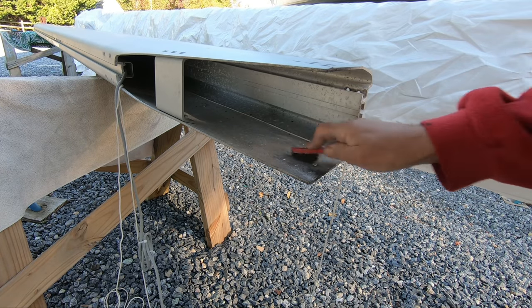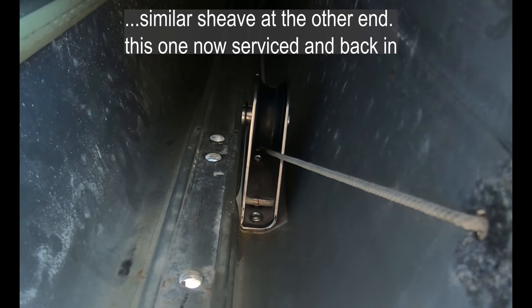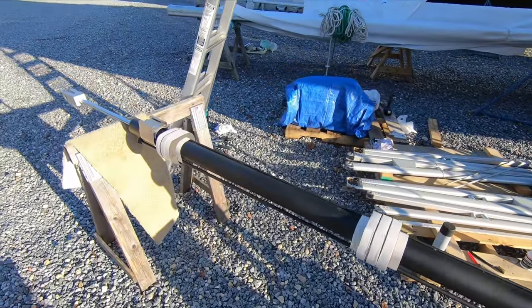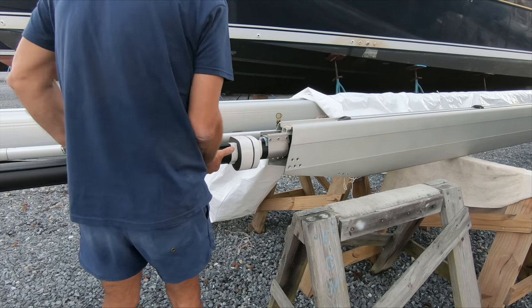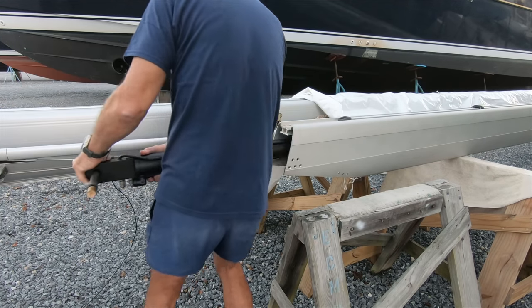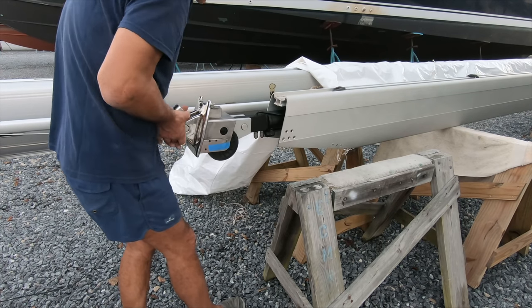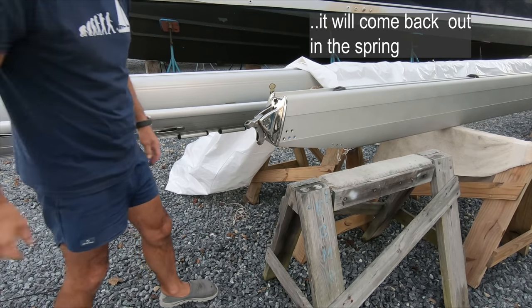This end gets all the salt, so when I put it back I'm going to put some sort of cover over here. I've put plastic and lanolin coat behind the pulley before riveting it in, and I'm going to drill a little hole in front of it so the water can get out. The outhaul hydraulic cylinder is now all back together and ready to go back into the boom. The shift carriage engages on the rail profile inside the top of the boom, and the beast goes back in. Then the gooseneck end is latched onto the boom end fitting. Voila — it's in.